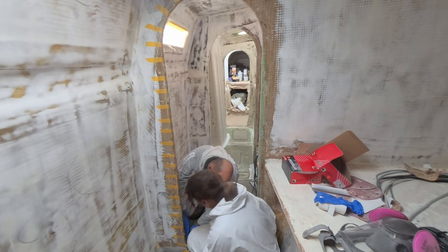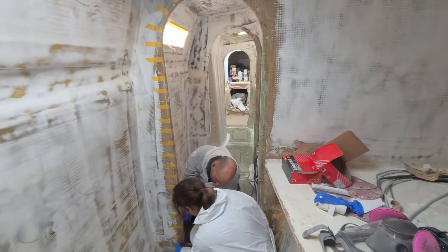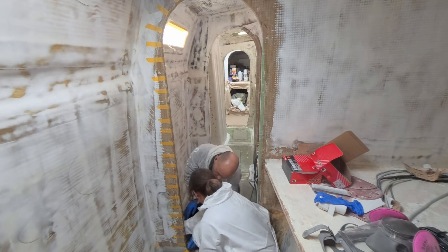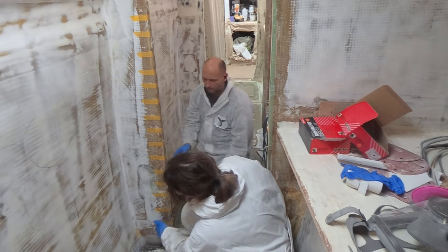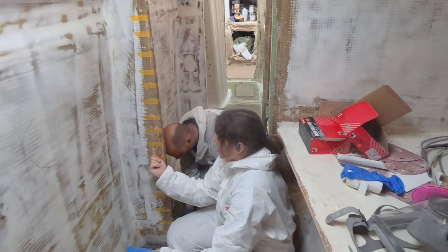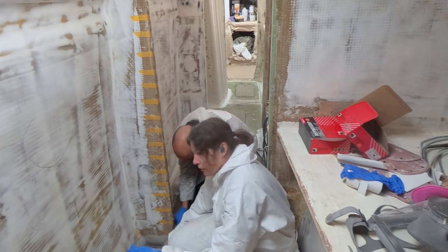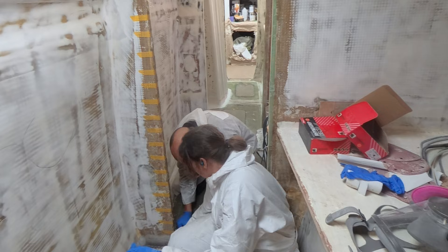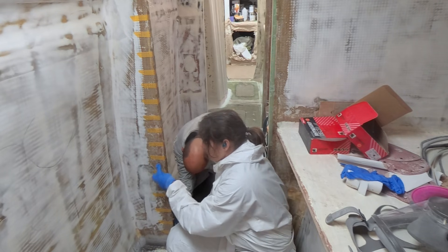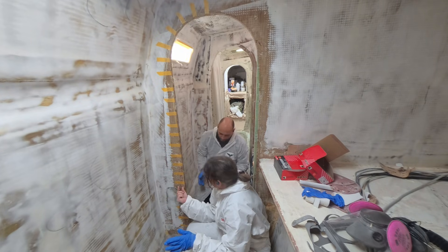What's the difference between this and edge capping? The edge capping ties the two skins together, whereas the uni creates longitudinal strength up and down. The two skins are this side and that side, so edge capping is just wrapping. On Pykeia, edge capping is the same thickness as whatever the skin is, and the overlap for edge capping is about 50mm.